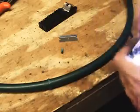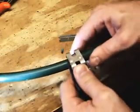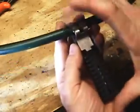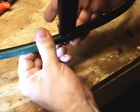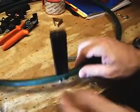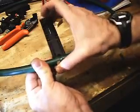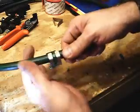It's kind of hard to start with the trimming tool because you got to kind of force it in. And you got to compress. I find it's best to compress with your hands as you rotate it around. As it comes around the back side, you'll probably see what it's bringing off. As I said, I'm compressing this actual tool into itself as I rotate it around the green round belt. And you can see what it's shaving off on the inside right there. Bring it completely around.